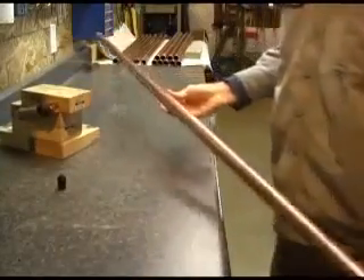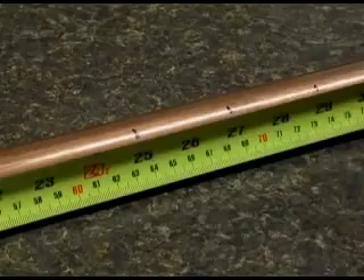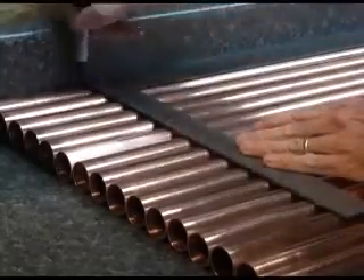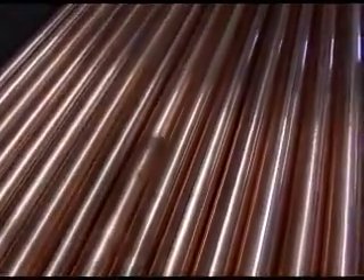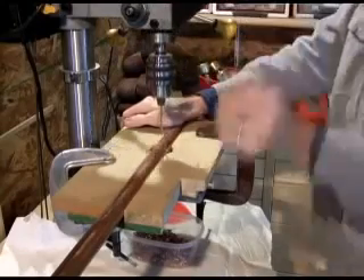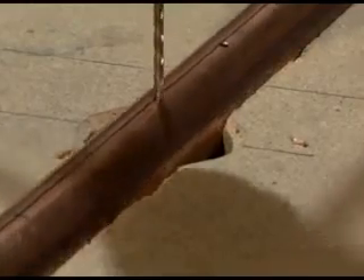This tube will be a header for a solar panel. Next, mark that line every 2 inches down the pipe for a total of 21 locations, centered around the center of the pipe. Line up all of your headers and mark all the other pipes identically. Once all the locations have been marked, it's time to drill a pilot hole. I use a 1/8-inch drill bit for the pilot hole. Another jig holds the pipe in place during drilling. Drill the pilot hole as close to the X as possible in the 21 locations.